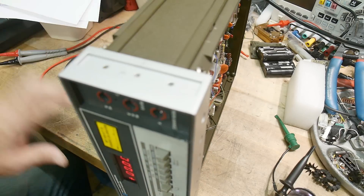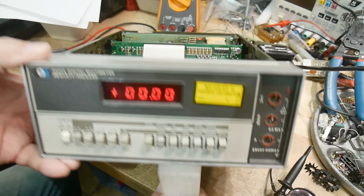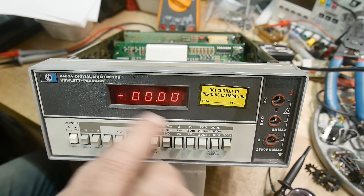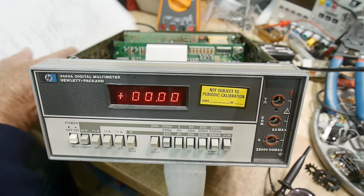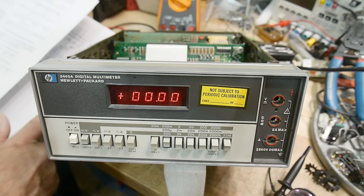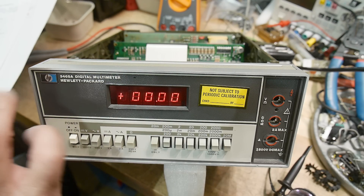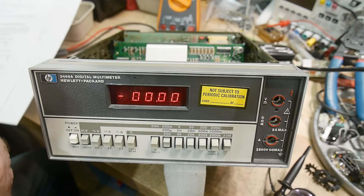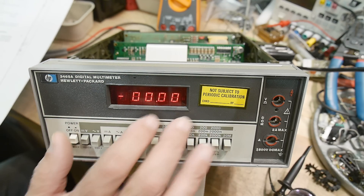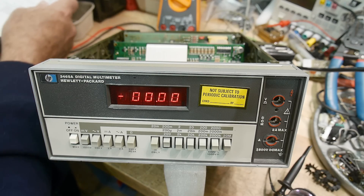Then it says to take a look at the front panel, so we'll prop this up and do that. You should get a '000' and a plus/minus flashy thing here - so that's good. Supposedly this jumper separates the analog section from the digital section so you can troubleshoot the display section directly and the analog section directly. This is good news - that's checking out.